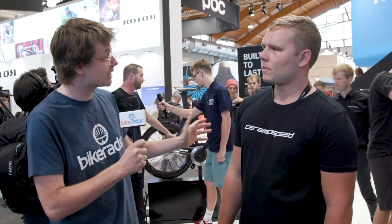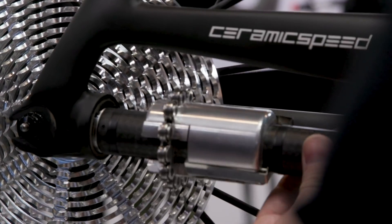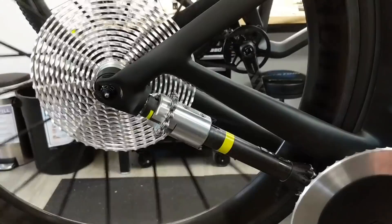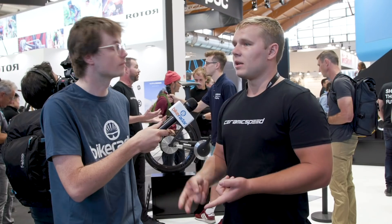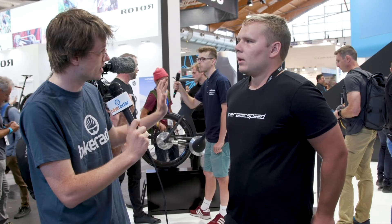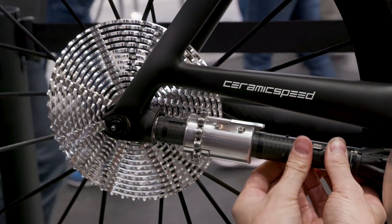The road version is quite popular and we're on a busy schedule today, so we're not going to get right in there, but Alex, would you mind explaining what's new with this version? The big thing is that it shifts — making it shift was our big challenge over the last year. The basic mechanism behind shifting is that we split the pinion, the rear rotating element, in two halves, so that the half not engaged with the gear moves first, meaning you don't have to overcome the torque of the drivetrain. That half engages with the ring, and then the second half moves to catch up — it always moves in two steps, so we don't need a powerful motor to overcome the load, and it doesn't have to move nearly as fast. It's driven by one motor — a very simple system — and one motor does one motion to complete a full shift.